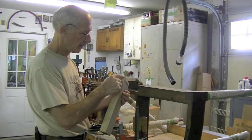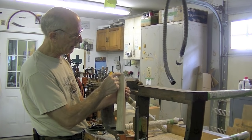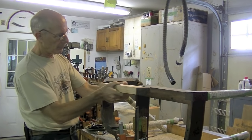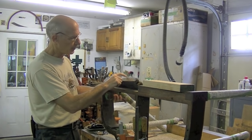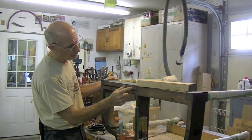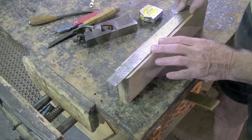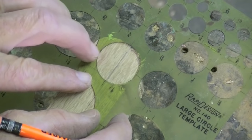I realized as soon as I cut this on the router it looked a little odd. I was getting ready to plane it down to complete my round-over here. Then I realized I made this board the same thickness as this board, which is 1-7/16 inches. But this board is only 1-1/8 inches thick. I realized that it sits like this, there's a space there. So my knuckle that I'm forming really needs to conform to the 1-1/8 inch diameter, not the diameter of the larger board. So I've got to make a saw kerf here and then remove some wood and then do the round-over again.